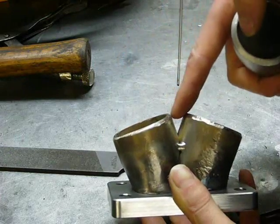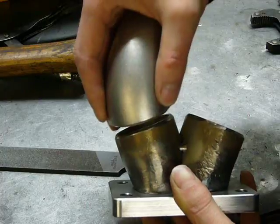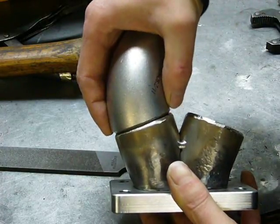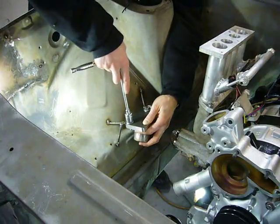The bevel I just ground matches up with the bevel on the pipe ends, and when assembled together, provide somewhere for the weld to penetrate into. Now, once this thing is bolted back to the jig, I can start laying some pipe.